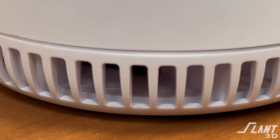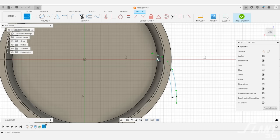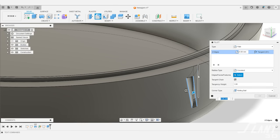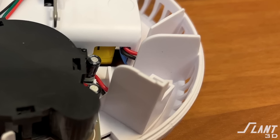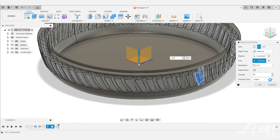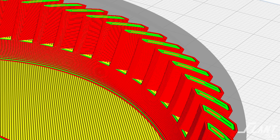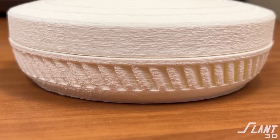The vents were challenging because there are a lot of them and they are straight, small features. What we do is make them longer by cutting them into the wall at an angle, and to achieve that we made the wall a little bit thicker. That was possible because inside there were ribs around the exterior to stiffen the part and act as finding features — taking up essentially the same volume as a thick wall. By making the wall thicker and cutting the vents through at an angle, you have much larger features so the tool head has more time to deposit material reliably, giving more structural stability and the same amount of airflow as before.